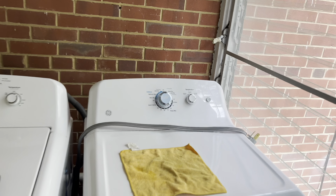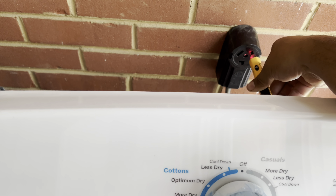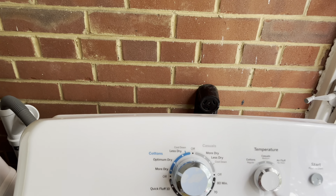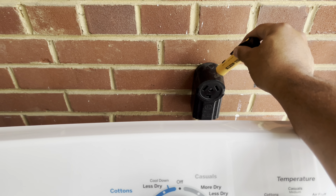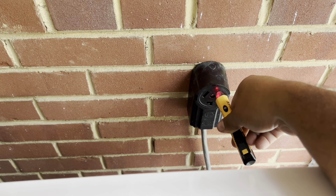We're back where the dryer is, at the outlet. With the tester it's on — now you've got power. Like I mentioned earlier, if there were wires touching here it would trip as soon as you try to turn it back on. But I opened this and there were no wires touching. Now I've got power to it.